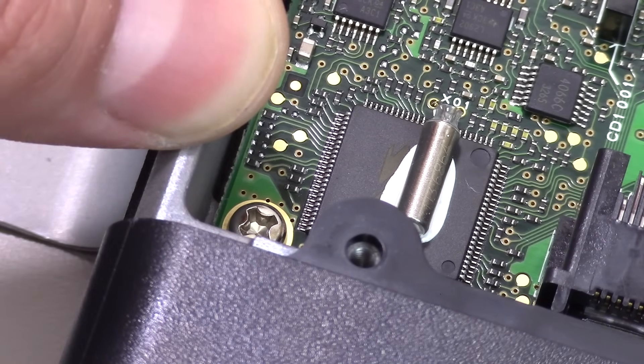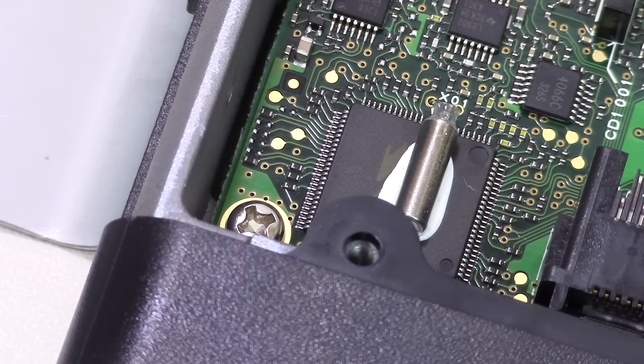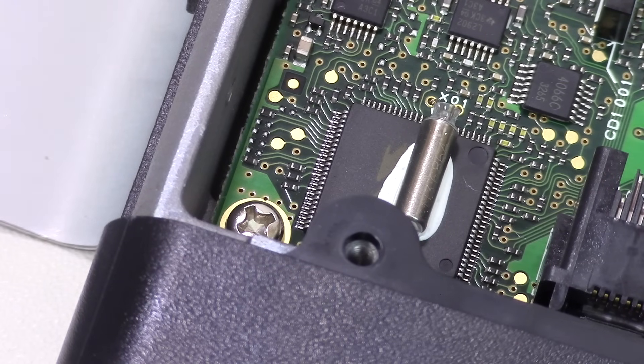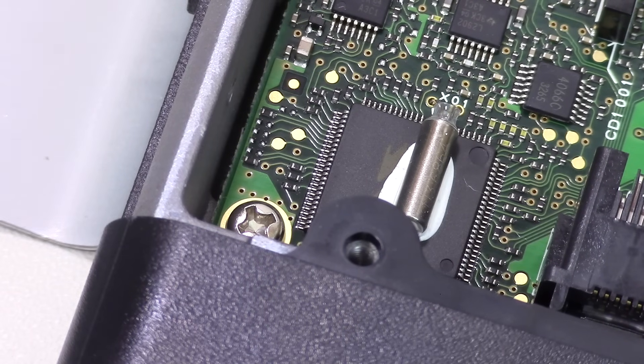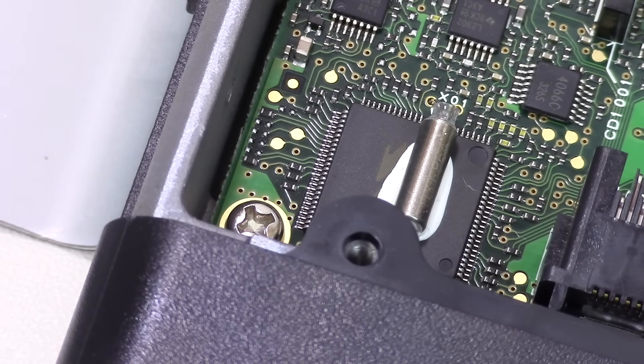This gives you a good idea of the size problem here and why it's a little challenging to remove this resistor. Let me switch the camera to manual focus to make sure it doesn't screw up while I show you the removal. When professionally modifying radios, I use either a special hot air soldering tool or a tweezer-type tool with two soldering iron tips in one device — you put it together like tweezers and it removes a part absolutely no problem.